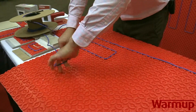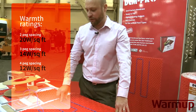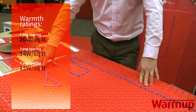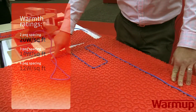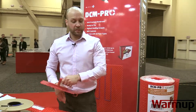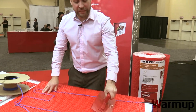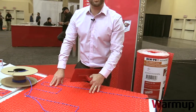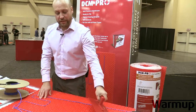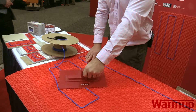At three-peg spacing it creates about 14 watts per square foot. Two-peg spacing is about 20 watts per square foot, and four-peg spacing creates the least amount of heat at about 12 watts per square foot. Once the wire is completely laid out and you have it in the area you want for your heated floor plan, your tile installer would come in and put mortar all throughout the membrane, making sure to completely fill all the different castellations. The benefit is that as you come in with the trowel, you're never touching the wire — never having the possibility of damaging it.